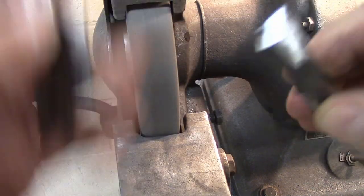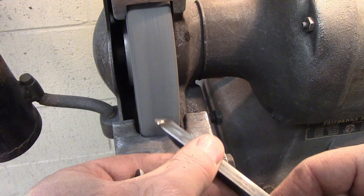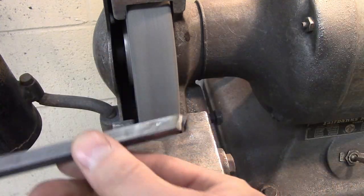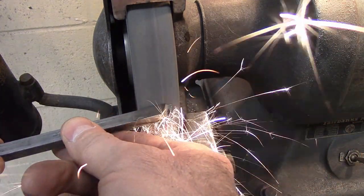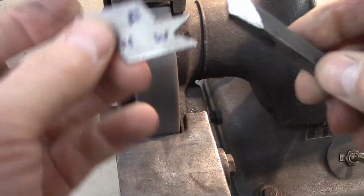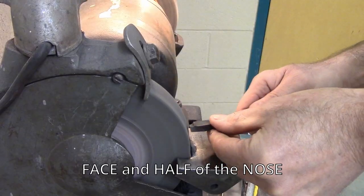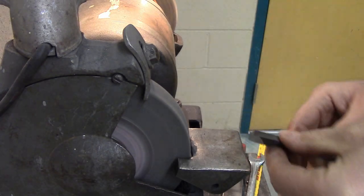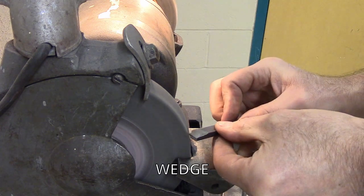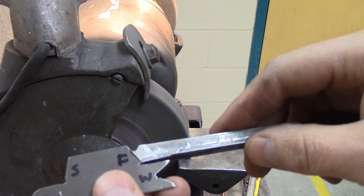If you get a good grind — even if this is mild steel — it'll cut. It just won't stay sharp for very long, but it works. For students, I don't grind them this way because they tend to be problematic long term. However: face, side, nose, and the last thing is wedge. It's a good idea to have a relief cut in there so you can get the tip of your cutter in the guide. The face, the side, and then that corner angle there. Practice, play around with it — you'll get it.